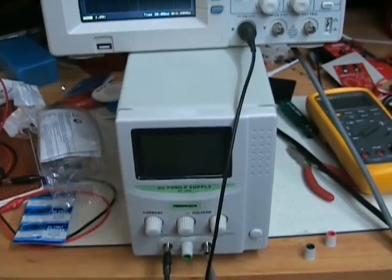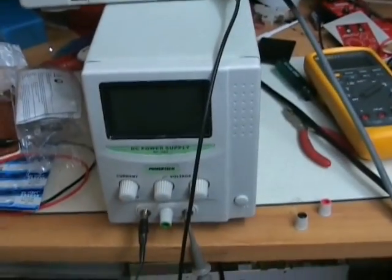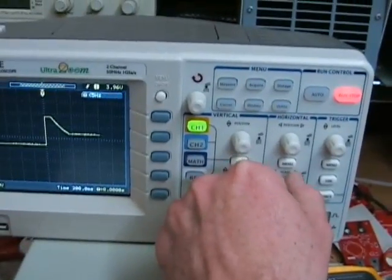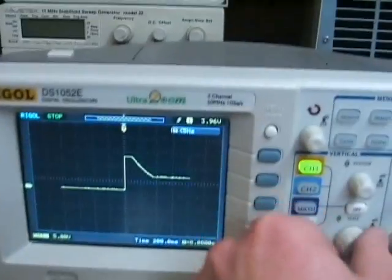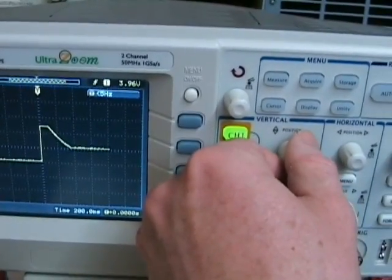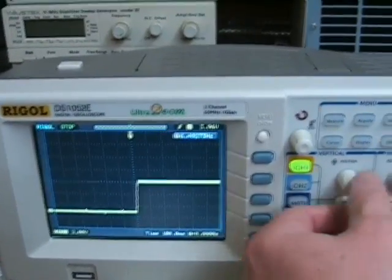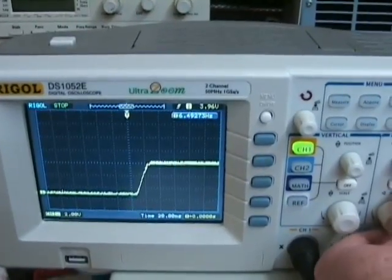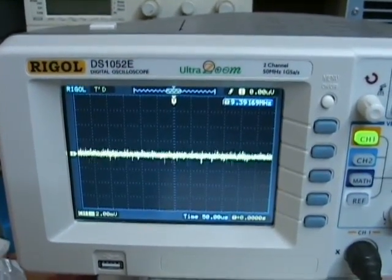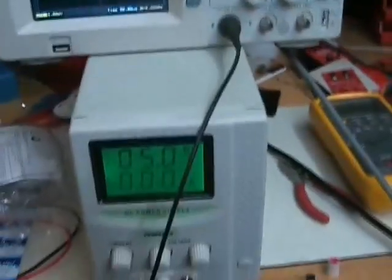One of the most important characteristics of a power supply is its switch-on performance, to see if it overshoots. I've got the scope set up here to trigger. Wham! There is big — check it out — there's huge overshoot there. That's five volts per division — that's massive overshoot. Let's try the overshoot again, and it ramps up very nicely there. So that overshoot we had before was just a furphy based on the previous output voltage. But still, that wasn't very good — something to watch out for. Testing the noise now — it's claimed to be one millivolt, and on two millivolts per division, yep, it's right down there. It's really quite low noise output.